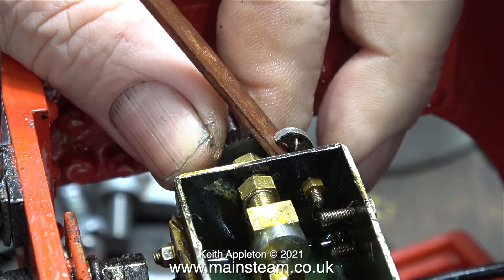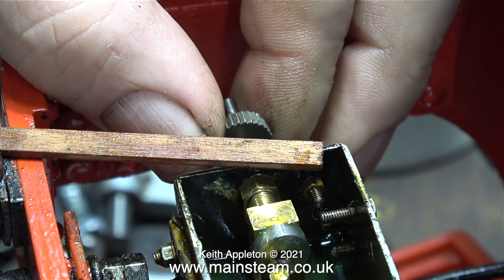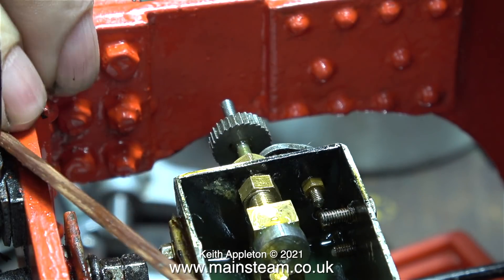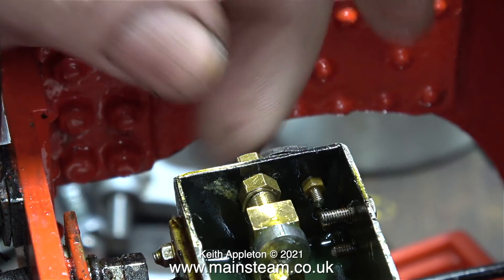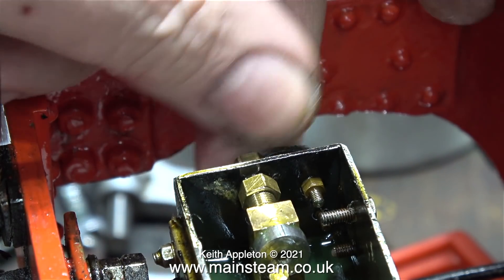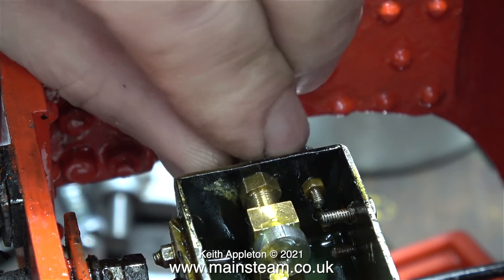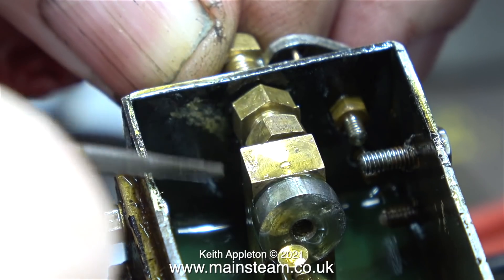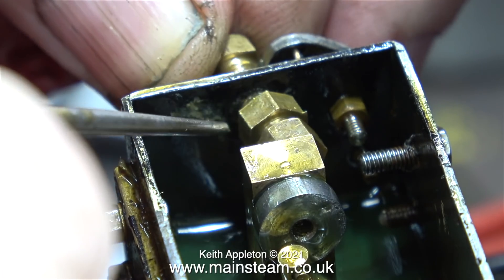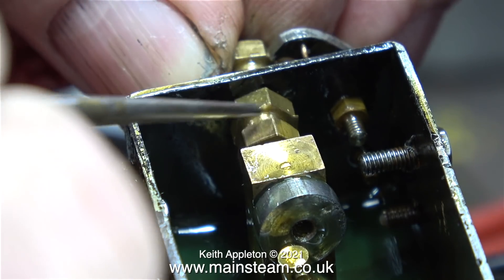In this clip I'm unscrewing the crankshaft from the crank web. I used a piece of mahogany to keep the pawl away from the ratchet while I did this. This is a very fiddly job and everything is oily, but patience is a virtue and eventually I can start putting the whole thing back together with the extra nut. When I built a 7¼-inch gauge Titch that I used to run around my garden railway at the other house I fitted a mechanical lubricator and it's never ever gone wrong.